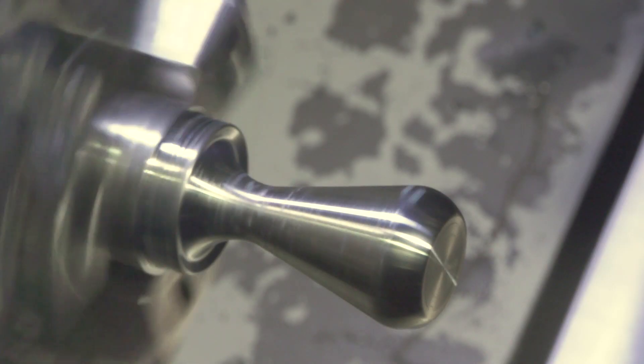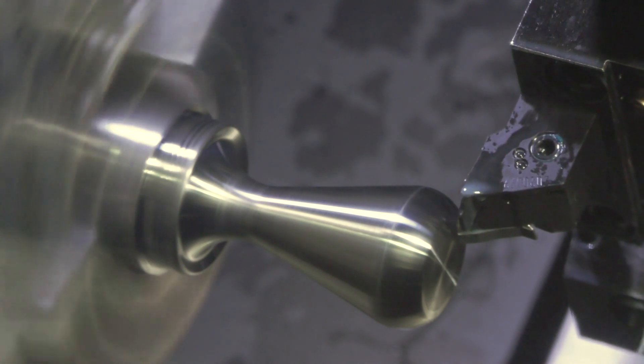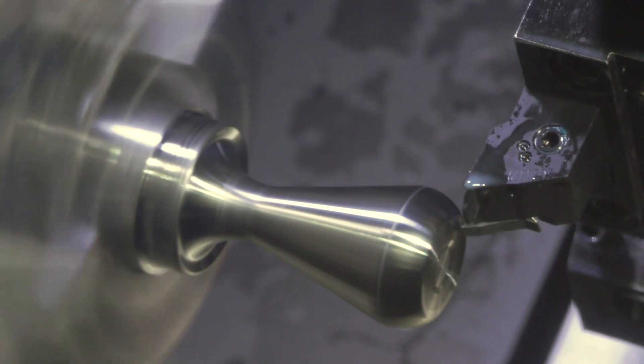And there's a nice little face grooving demo on this part as well? That's right. The WL system will face groove and also we've produced the shallow dish on the front of the part as well. Now just to finish the part off, we're going to precision groove it and then part the job off.